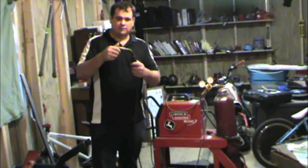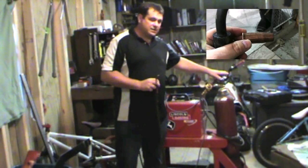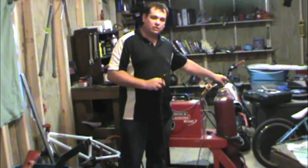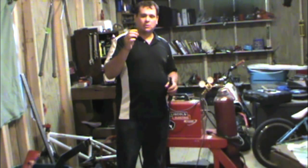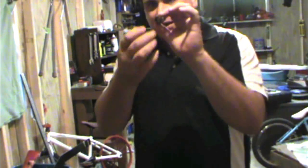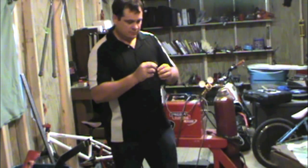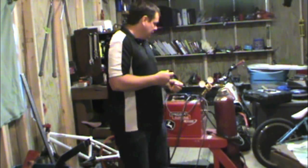This is your gun, this is your gun nozzle. This is what directs the gas to your weld. This is the gas that we use, which is 75% argon, 25% carbon dioxide — we'll talk a little bit more about that in a minute. But without the nozzle, this gas would escape and not be directed towards the weld. As you're welding, you can look in here and there's a little bit of slag. That slag builds up, and if you notice there's a bunch of slag clogging this nozzle, that's going to restrict your gas from hitting the weld.